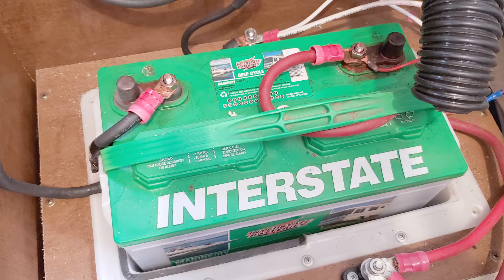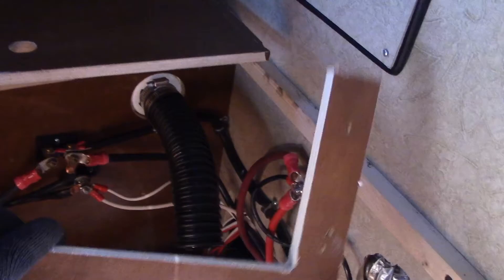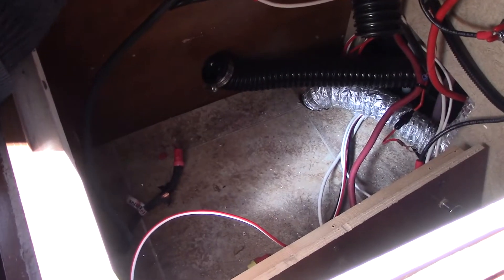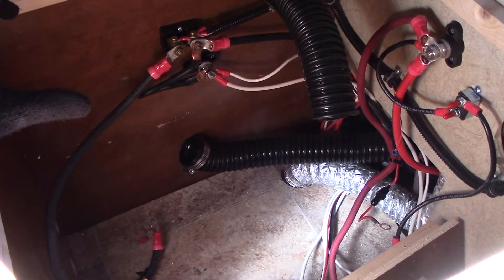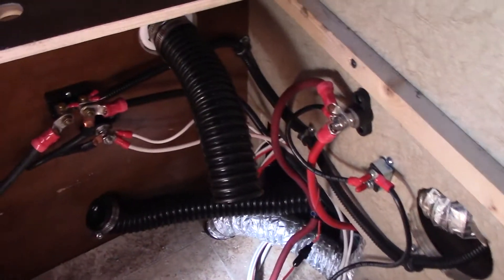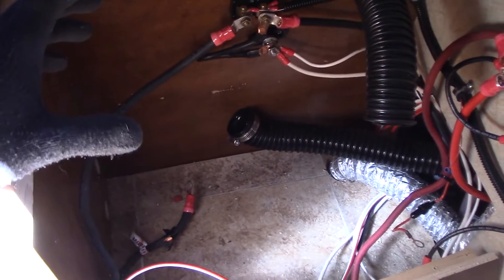The way it was set up there was no room for any more batteries. All I had to do was remove the cabinetry built inside and the battery box. There's definitely room for two six-volt golf cart batteries, which is the common upgrade because golf cart batteries have a lot more capacity. We're going to be way more than doubling our amp hour capacity, charging capacity, and run time. We're going to put two six-volt batteries in series, which will make 12 volts and it will charge the exact same way.